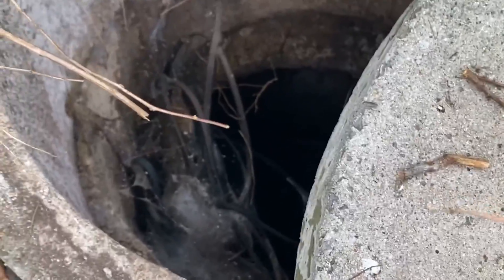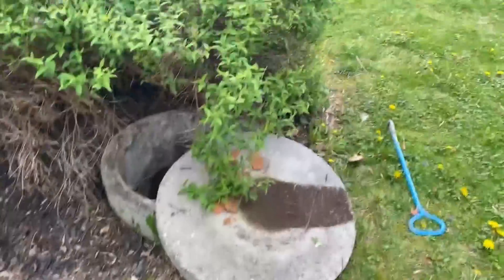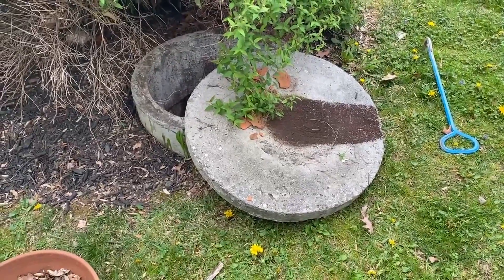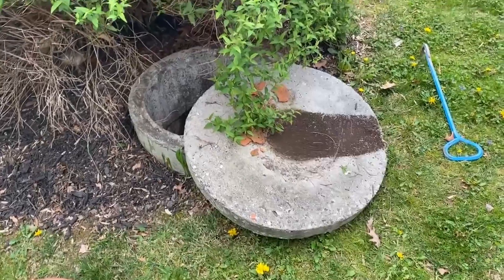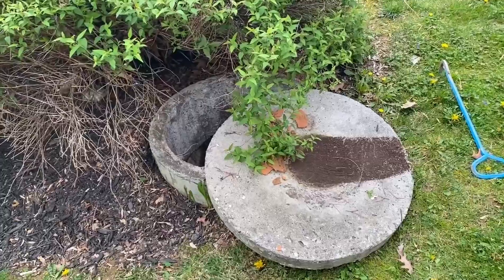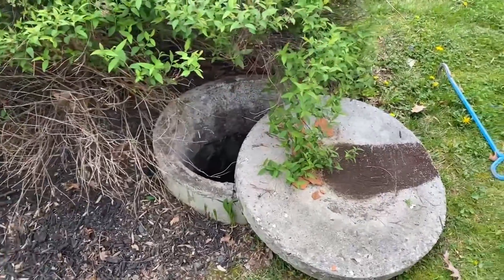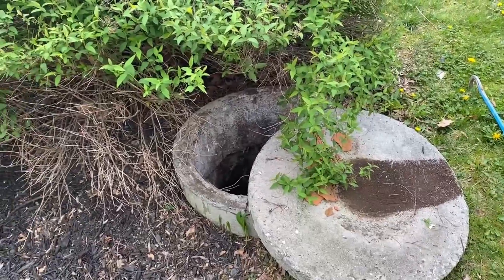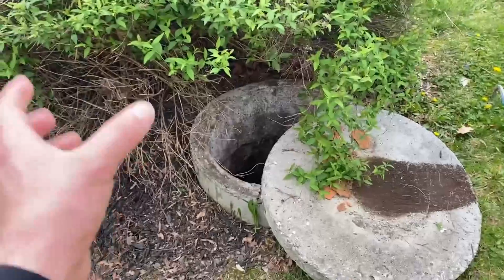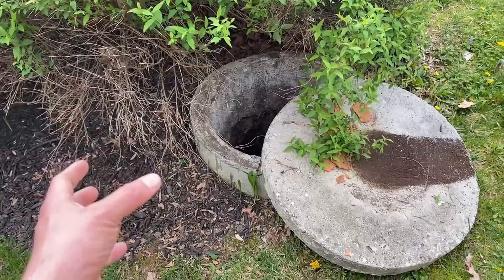In this particular riser the top ring has shifted about half an inch and all of the electrical connections are inside. Sewer gases are incredibly corrosive — they will chew up all sorts of metal and concrete and corrode your connection points, putting you at risk of the pump failing to cycle. When we see a riser that has shifted on a pump chamber, we recommend preemptively replacing it and getting the electrical connections on a post in a nice secure sealed box.